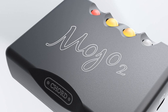But then you've got the situation: if you're using a bright headphone, how would you make it sound warmer and more natural? That's why I thought, if I'm going to get rid of the coupling capacitor, we need to add EQ as a way of helping people deal with cheaper headphones that are too bright, too aggressive, or don't have enough bass. So that was why I decided to go for the EQ approach. And then the question became how do you make EQ actually work? Because at the moment it doesn't work.